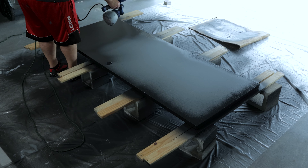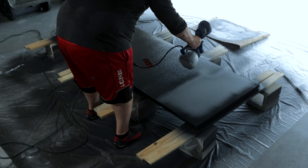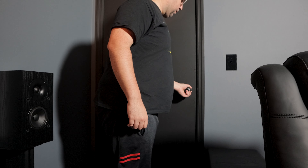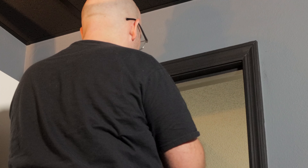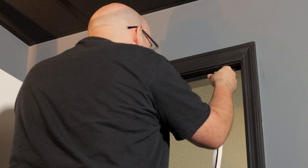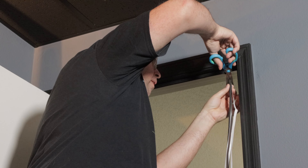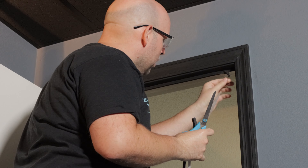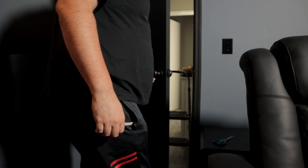There were also a couple of things I wanted to address, the door rattle being the first one. After I painted the door, put it back on the hinges with the help of my wife, and installed the doorknob, it was pretty loose in the frame. This proved to be a major issue — the door would rattle with any deep bass that would play. So I grabbed some cheap black weather stripping off of Amazon, put some at the top of the door frame as well as some smaller strips in other spots, and I think it worked out pretty well.